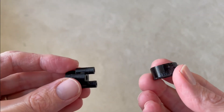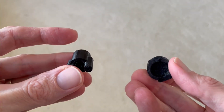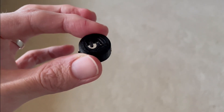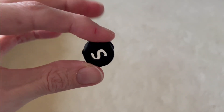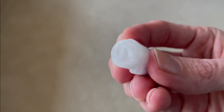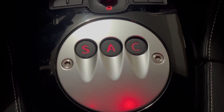To avoid finishing issues like the factory, I created a two-piece button design after a few iterations of work in Fusion 360. This allowed me to copy the top section four times and extrude out the letters in the cap so the letter is actually hollow. The inner section is printed in semi-transparent PETG, allowing light to pass through it and still light up the letter.